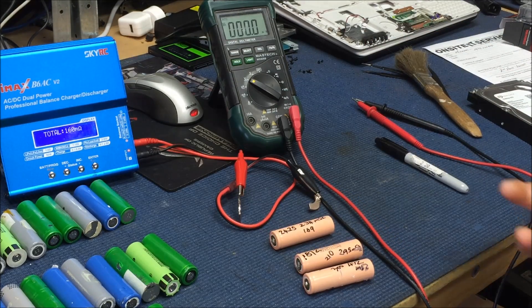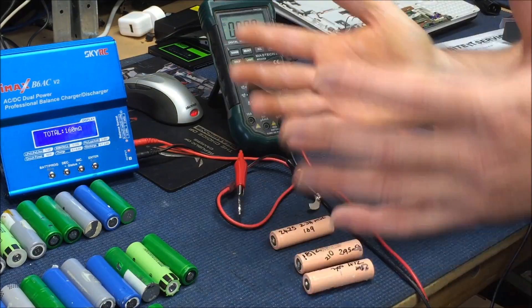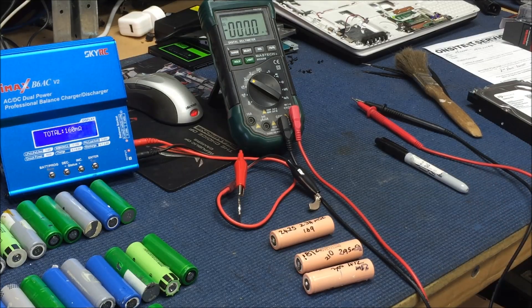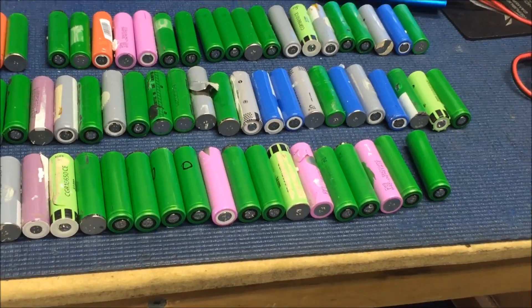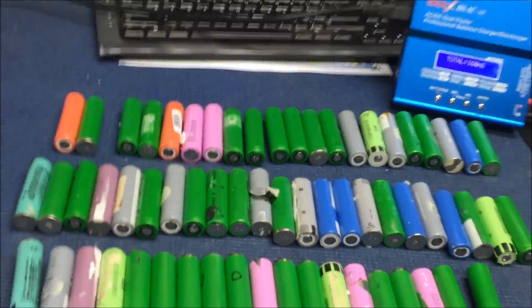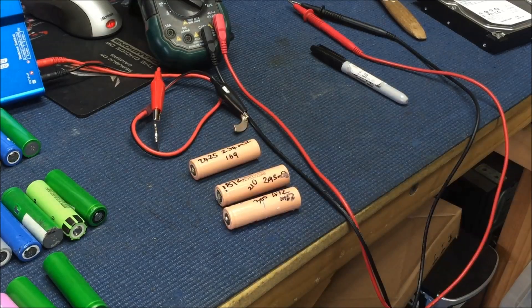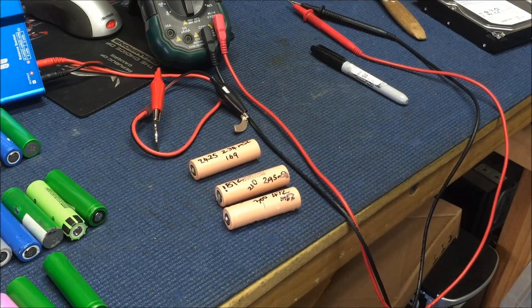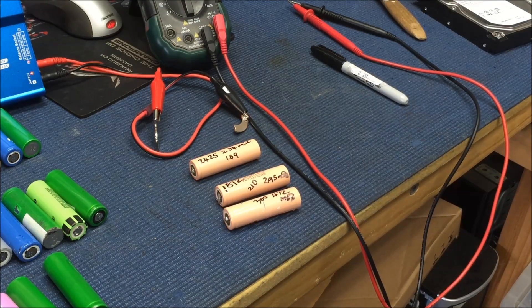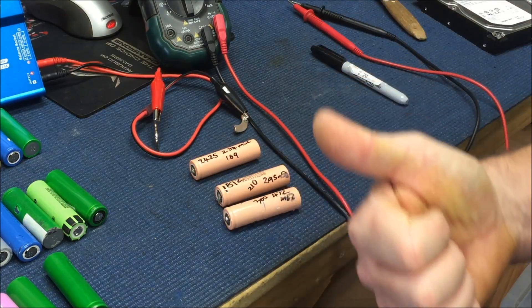I don't know if it was a test or me talking aloud, but that seems to be what I do lately — lots of talking aloud because I'm not making much progress on anything else. I am going to resistance test and voltage test all those batteries I've just processed. I'm going to do that now and do exactly the same test with those cells tomorrow. The time is about 10 o'clock in the morning, so I'll try and repeat the same test tomorrow at 10 o'clock. Cheers YouTube, and if you like these videos please like, rate, and subscribe.